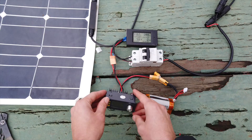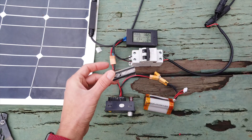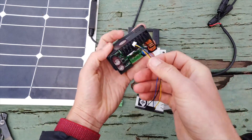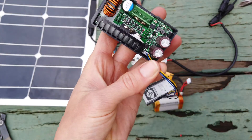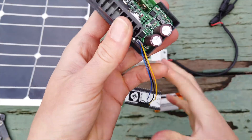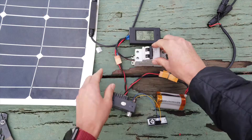Alright, now if we disable output and we connect in the ESP32, we connect it into the back of our DPS. I'm going to power this off. You can see this tiny little connector up at the top, and use a screwdriver to seat it all the way down. Perfect. We can plug back in the battery and power back on the solar panel.